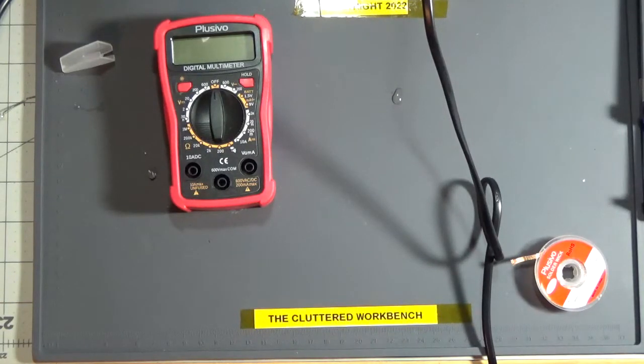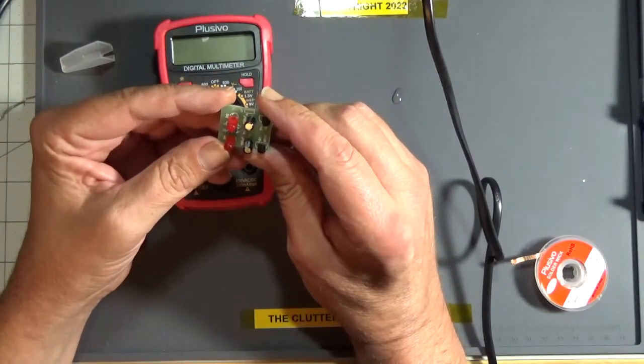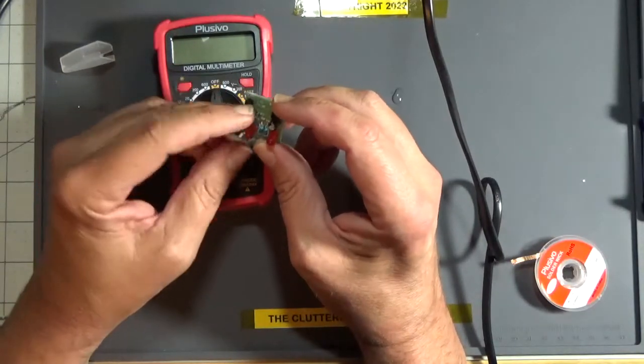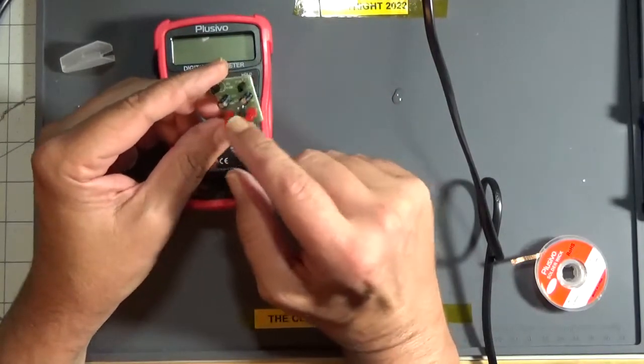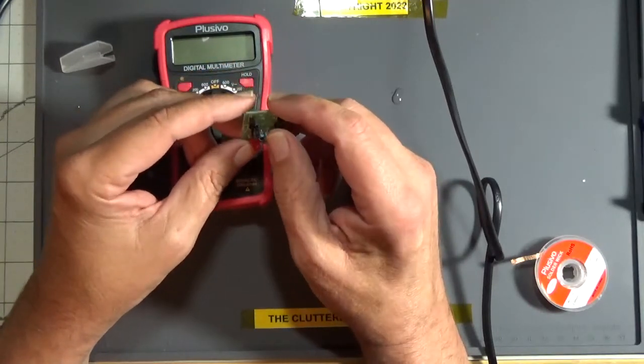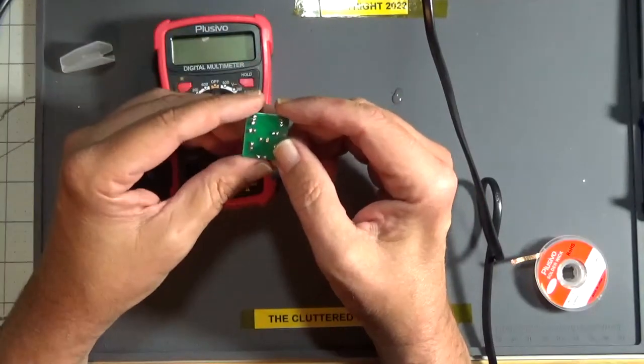But you can also go on Amazon or eBay and you can build one of these little inexpensive multi-vibrator circuits. It's 2 transistors, 2 resistors, a couple of capacitors, and it makes the LEDs blink. Kind of like a railroad crossing. It's called a wigwag. Very simple kit. Works, good soldering practice.